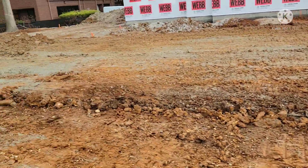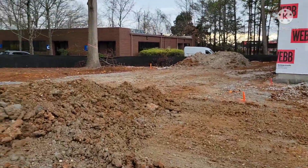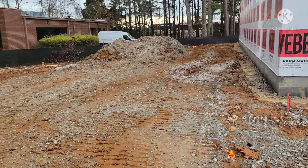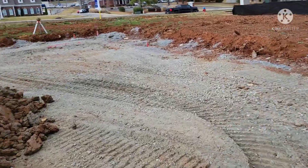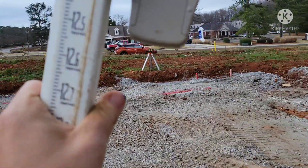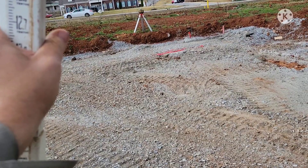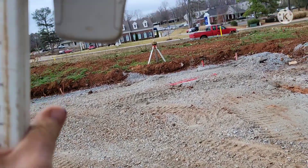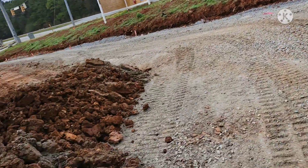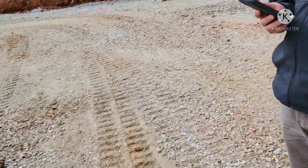Do you know how much lower you have to build this one? About the middle of your dirt pile — it shows where the swale actually starts. Let's walk around just to be sure. If we had GPS we'd be set up — somebody would build a model, stick it in the machine and it would do it all for us. You don't lack much. Is that about how far you need to come? Yeah, about right here — so you're about six inches. This is where the 658 line is, and then it rises from here, so I'd start it right here.